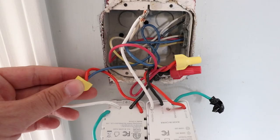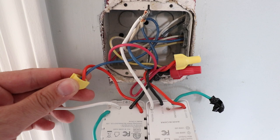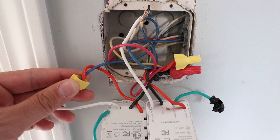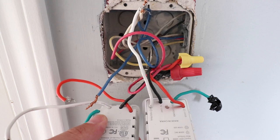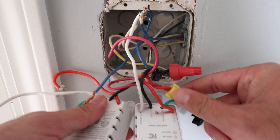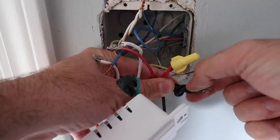In this case it's designated with a different color — this blue wire — but that is not always the case. The load wire on traditional switches is also typically on the top terminal. We're going to go ahead and remove this blue wire and make note that it is the load wire. Now the last wire we have to remove is the hot wire — the incoming black wire — connected with the incoming hot wires into this junction box. So we're going to remove this wire nut and then remove that wire for the hot wire.